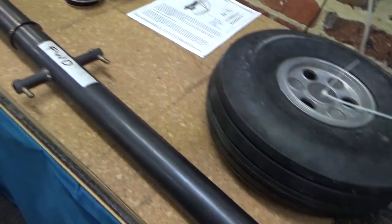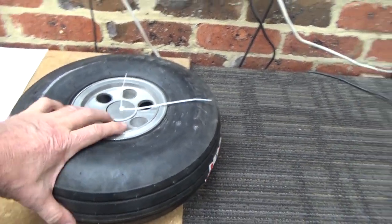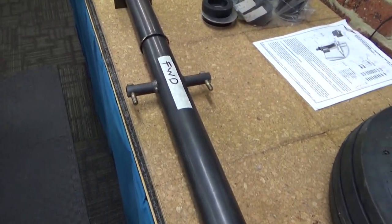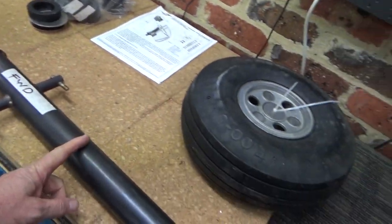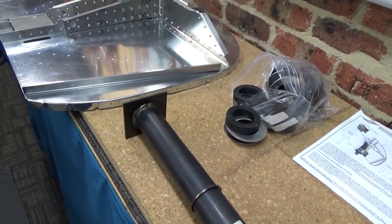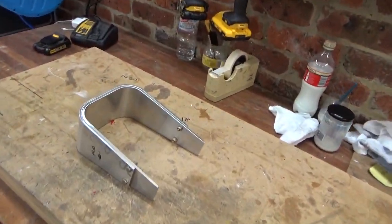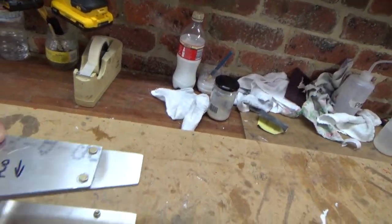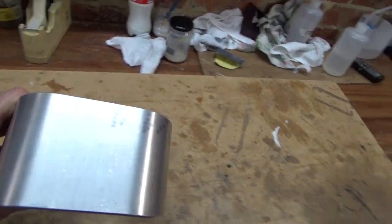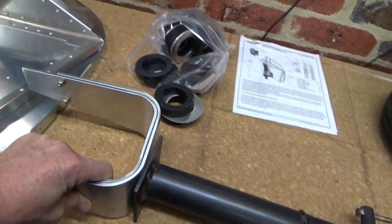It's almost time to start thinking about these steel parts. Assembled the wheel - I've just put 20 psi in there, so if anyone has got a good idea what pressures they're running, let me know. We're doing the nose strut, and with the puck system I'm not sure whether to paint the bearing surface. Might get all my steel parts out and get them painted. I made the fork - tonight I'll have a look at drilling the axle. It's a 19mm hole for the axle. This bit joins to this bit - so that's your fork. The nose strut going forward has got a taper, which gives you a little bit of trailing to center the wheel, a la a shopping cart. Meet Forky!